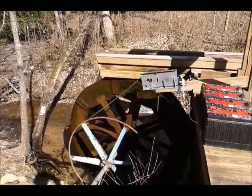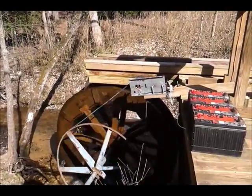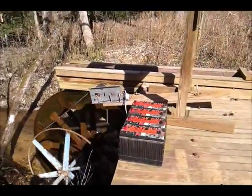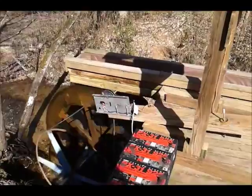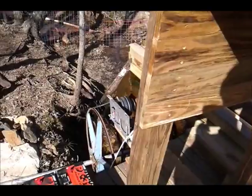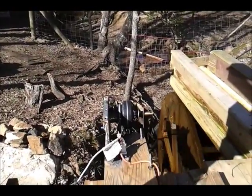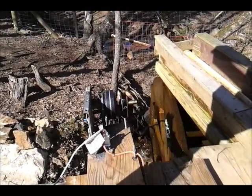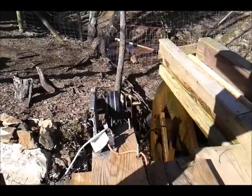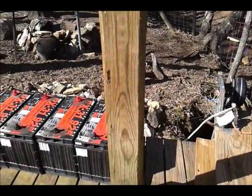Angles really mean something when you're making a circle because I had to do some rigging when I tried to close up my angle. A gentleman called Muddy Man posted a little thing on YouTube about a ceiling fan — able to do some modifications and convert it to an alternator. Everything I've done there is jury rigging. Right now I'm just running straight off the coils. I hadn't put the rectifier in yet to convert it to DC.